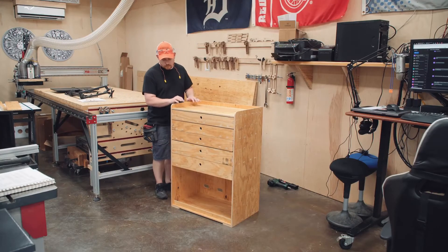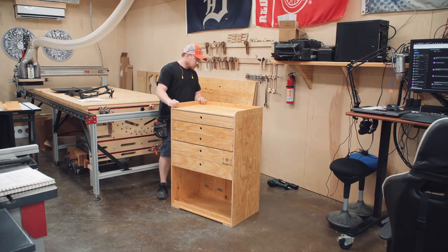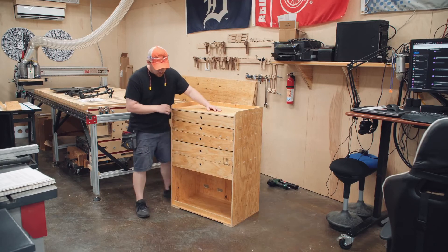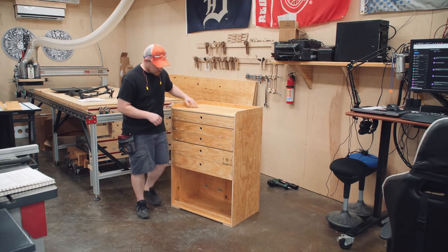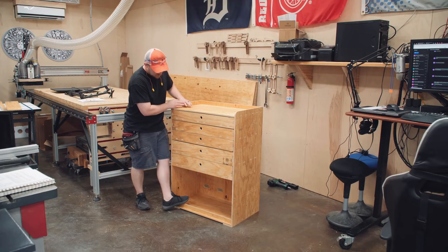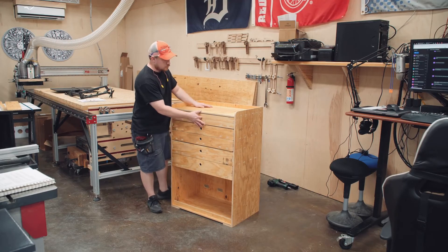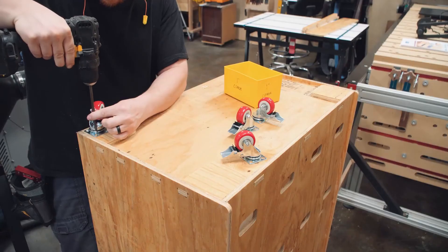This is just half-inch CD pine plywood, so I'm not expecting kitchen cabinet stability. I wanted to see how much flex or rack was still in the completed build, and with a foot immobilizing the bottom I was able to get a little flex out of the cabinet — but this is kind of expected with this grade of plywood. It's still plenty strong enough for this application, and all of the flex is in the plywood itself and not the joinery.